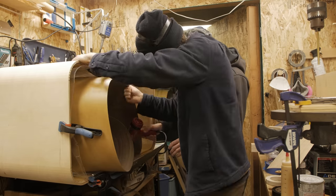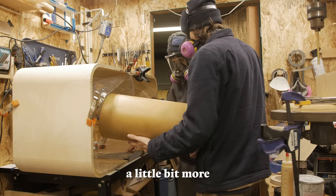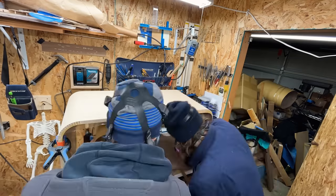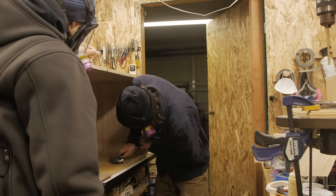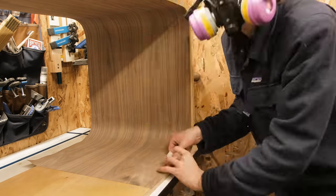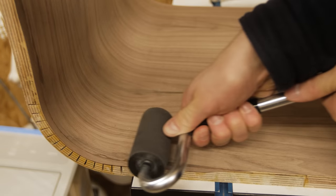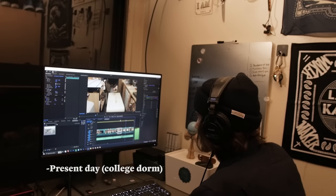After some quick thinking, my dad got the heat gun and we were able to slowly melt the glue and peel it off. We're going to overlap this side a little bit more — it appears to be working. But things aren't always as they appear. Turns out my plan of overlapping the front side more to compensate for any misalignment really backfired, and I was left with about an inch-wide gap. After splicing in a strip of veneer it was almost unnoticeable and I was feeling pretty good that I managed to save myself from that mistake.